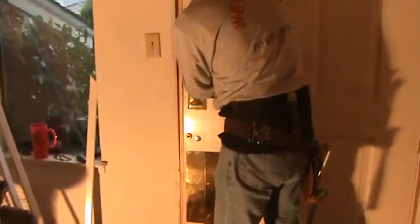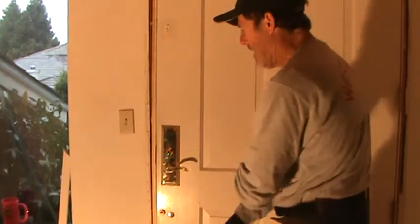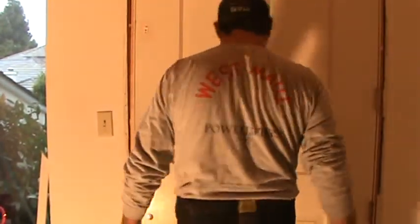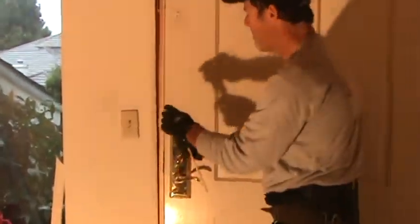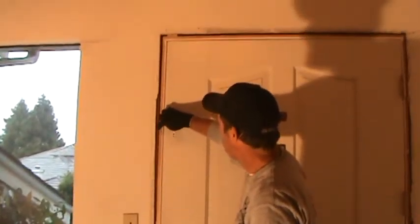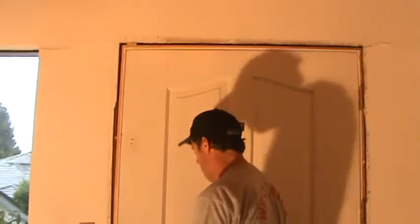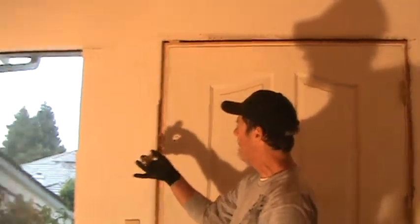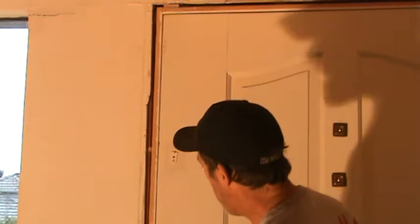I closed the door and checked the reveal — it was a little bit wider and I needed some shims. I didn't have any door shims here, but I had a paint stick. I used that as a shim, it fit right where I needed it, and I cut it off with my sheetrock knife. Then I had the little piece of wood I cut off the pine door jamb and wedged that in there as my shim. I pried exactly where I wanted with a big screwdriver, put the shim in, and now it's set.